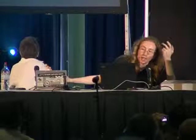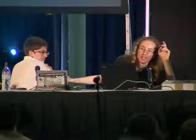So now let me read her arm using my RFID tag reader. You'll see a couple dots on my arm if you're close enough. That's just because we wanted to mark the spot where my RFID is. Those aren't a result of the RFID. What I'm holding against her arm here is the read antenna. Depending on the structure of the antenna of the tag, you'll use a slightly different read antenna. Perhaps you saw it on the slide where we had a picture of the tag close up. The antenna on the tag is a ferrite rod, fairly long and skinny with windings on it. In this case, the read antenna sort of resembles the tag antenna. So that's kind of comforting. And this is what works best.